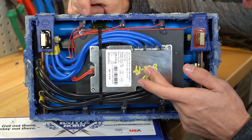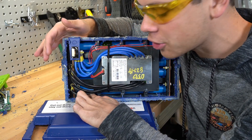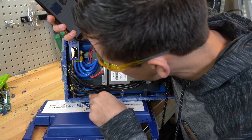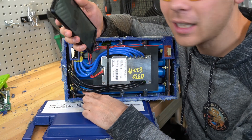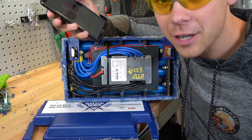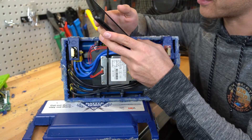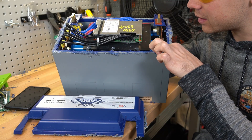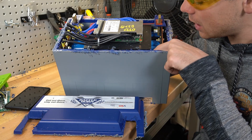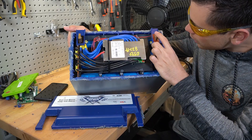The number on the cell tells us it's a 26650 — larger than the traditional 18650 found in older Teslas or laptop battery packs. There's a model number on the battery, but I can't find it on Alibaba or anywhere else. I do know it's their proprietary cell and they go to their own manufacturer and match the cells. What's really cool is that the cells are a clear inch away from the BMS, which will heat up under large loads. They understand that, so they keep it separated with a plastic barrier. There's actual copper in here — really good stuff.